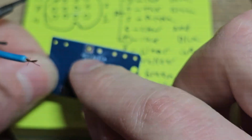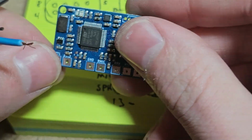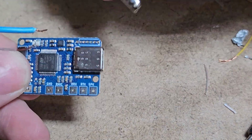And note that for radios where you do have more than one source of ground, the ground pad is also exposed on the bottom, right there. So you have a second pad, so you can solder more connections on there if you need to. It depends on what you're using for cable. So the helping hands come in handy here, but they're not necessarily needed.